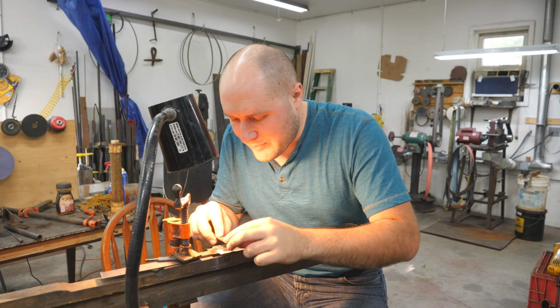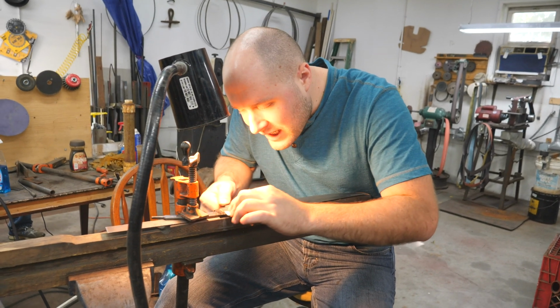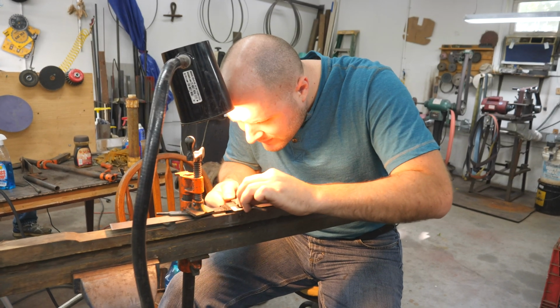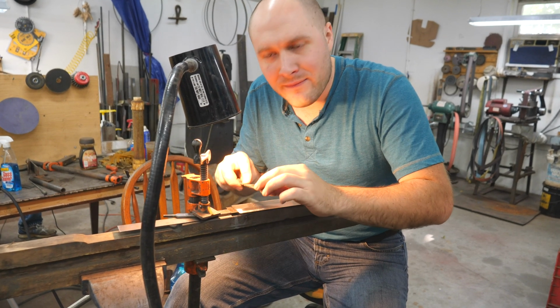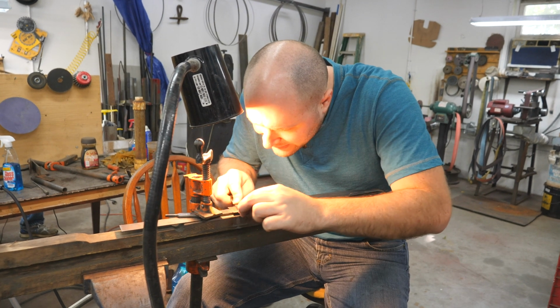So to go along with tip 3, using the sandpaper just like 50% of the way and then trashing it. It's a brand new piece of paper there. Do a little bit of sanding. Oh, it's still cutting, but not as good as it was. It's probably got 40, 50% life left. Flip it over and use some brand new fresh section.